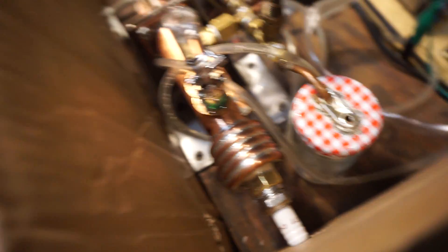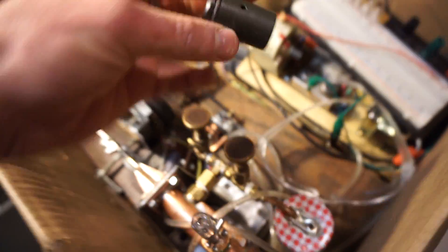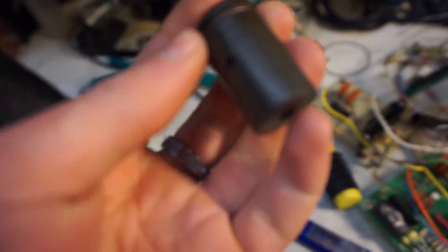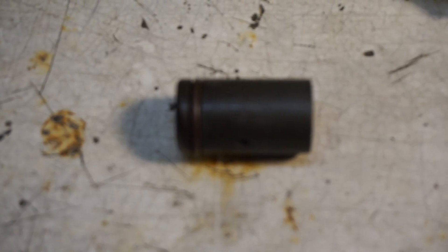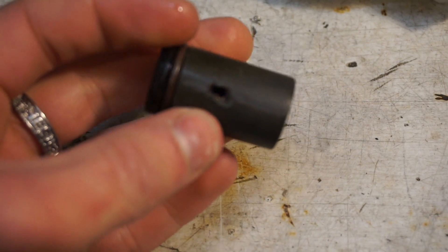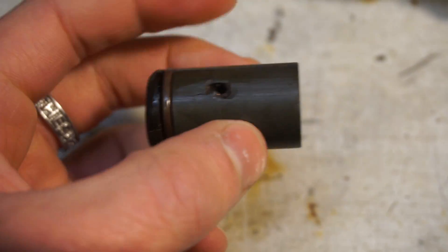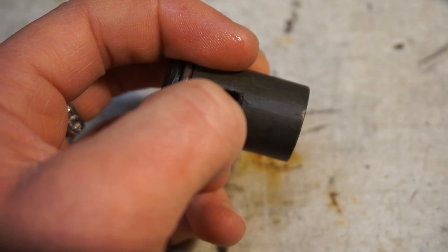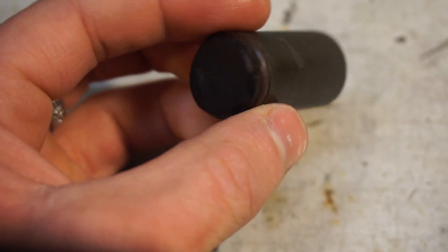There's a water jacket on there. It actually slides off — it's a three quarter inch connector, a little bit bigger, and it slides on there. And here is the piston — the actual piston is JB Weld, and there's a Viton O-ring on there. This is the old piston. The new one is in there now because this one actually started to crack. You can see the con rod — although it's not really a con rod in this design — has a crack starting to grow, and it got a big hole because the con rod cracked right in half and was just wiggling around in there. So I decided to make a new one, and there's a new one in the engine right now.